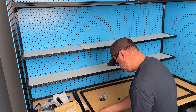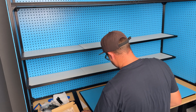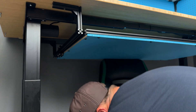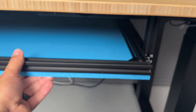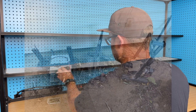The next thing I needed to make was my under-desk sliding shelf. Going into this part of the project, I knew it was just going to be kind of difficult — it's a complicated concept and I designed it from scratch. I made the main base of the shelf with an aluminum rectangle and a painted piece of particle board, then attached V-slot rollers to the shelf so it rolls on aluminum extrusions rigged to the bottom of the desk. My first attempt didn't work — it was way too wobbly — so I added two more rollers, and after that it was working just the way I had imagined it.